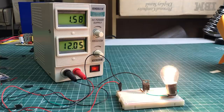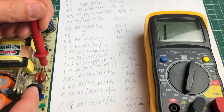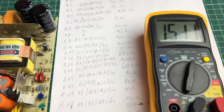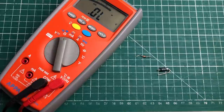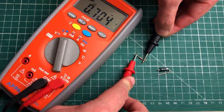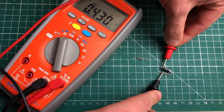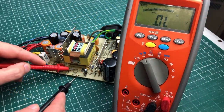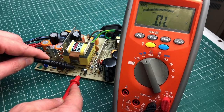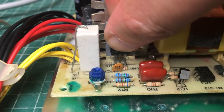It's not only transistors and diodes that need checking — the resistors on this PCB also need to be verified. I went through all of them, marked their color codes and ohm values, then verified each with the multimeter. I also checked pretty much all of the diodes in the circuit using the diode test function: a voltage drop in one direction and an open circuit in the other — all of these checked out fine.